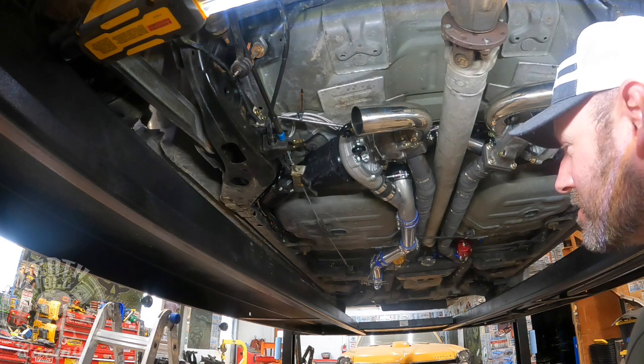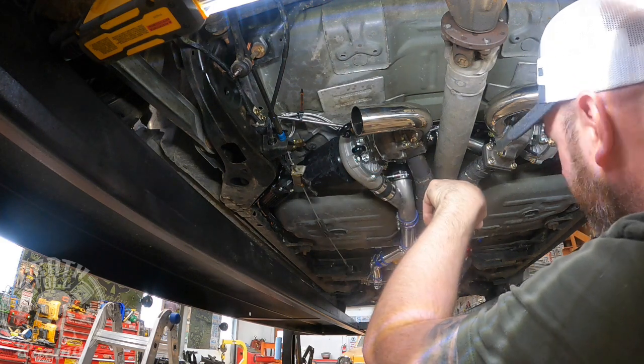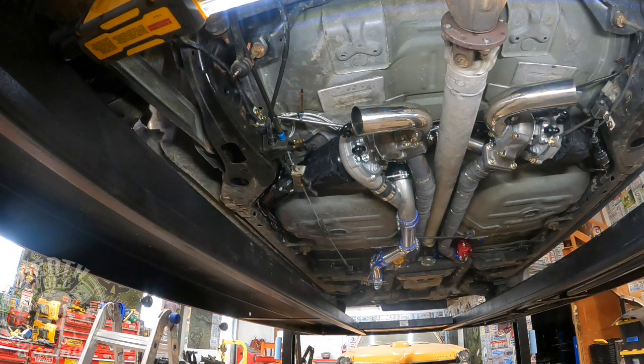What's happening is it's just sucking air past the oil — it's not actually sucking the oil uphill, which I guess is to be expected. I believe once we have the oil system below the turbos this is going to work. Drawing it uphill like that, especially with two turbos, I just don't think it's possible for that to actually function. So I'm going to turn it off — it's probably going to pour oil everywhere.